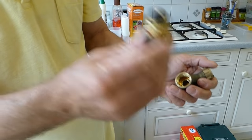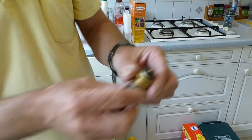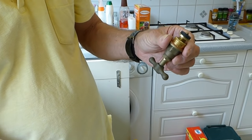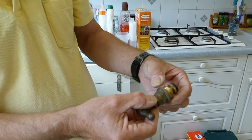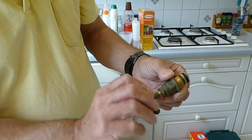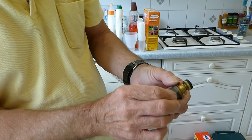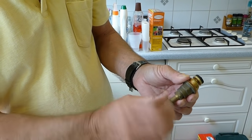It's well worth trying. If it doesn't fit, once you've got your old one out, you can then use oil — the usual stuff — to try and free that up, squirt it down there. Some people even lay it in a pool of oil overnight, in the hope that the oil might get down that thread and free it. And once again, once you start it moving, you can do it. You can also put it in a vice if you have one in your garage, and really get some movement on there. Once it gets moving, you might have a working stopcock back.